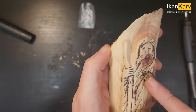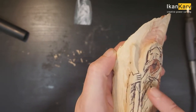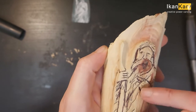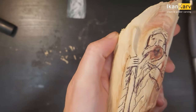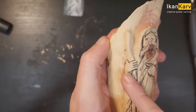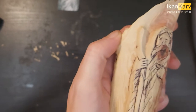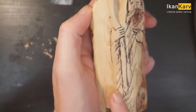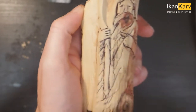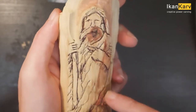I can cut this in deep, cut that right down the side of the staff with a Kutzall burr, and that'll be deep enough for the cloak. It'll fan up in here and cut around the hand, and they're just getting cut in nice straight lines the way the cloak goes. Same way this outside bit's just going to get cut off in lines because that's rounded off. I'm going to cut down the side of the staff either side first. I'm going to cut that lower, then I'll just round it off, and we'll come in and detail cut it all.